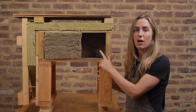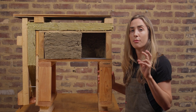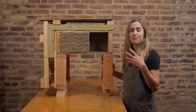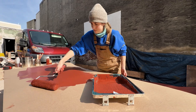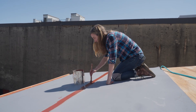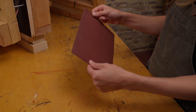Most builders are going to be using some kind of plastic or petroleum-based membrane here as an air barrier. We wanted to avoid that, as we're worried about moisture inside creating mold and mildew issues. An alternative might be a rosin paper or just a paper-based product, but the criticism is that it will break down over time. So what we were able to do is create what I'm calling the Earth and Flax linoleum — a linseed oil paint impregnated in a recycled fiber or paper base — and we're using this as our breathable air barrier at this stage in the roofing system.